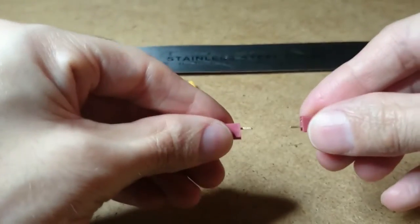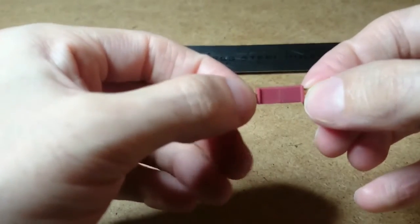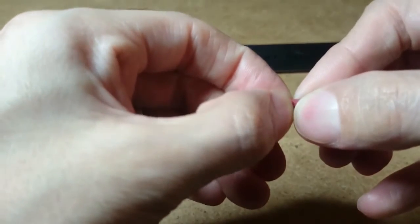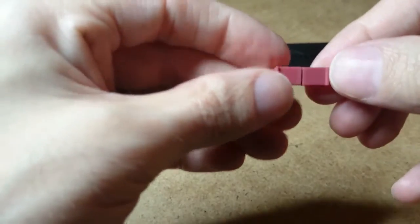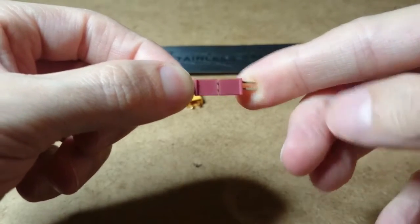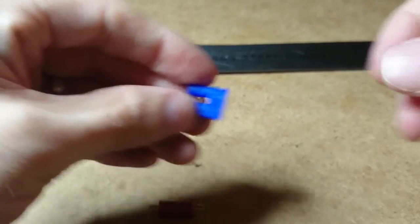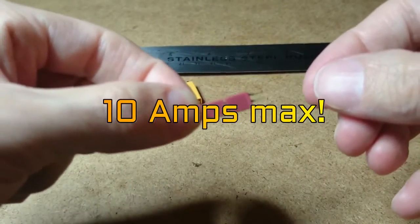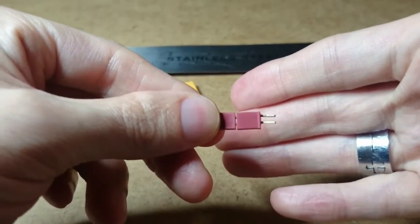So I thought to myself, why not go for the Mini Deans. The problem with the Mini Deans is that I think they're more towards brushed quads and smaller quads than brushless quads. As far as I'm aware they say they can carry a current of between 10 and 30 amps, but I don't think that's true. I think the max amp draw you'll get from these little Mini Deans is something like 10 to 15. With the EC2 you get a max amp draw of 20, so we needed to get up to 20 amps. They might pull 20 amps but I wouldn't want to risk it — if they were struggling it would heat up the battery. So I said no to that.